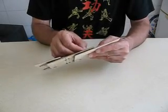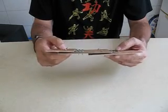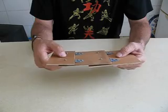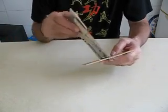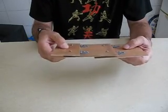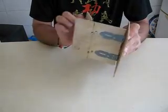This is my magnetic offset hinge — multiple hinge version — and it looks like a shingle on a roof. We just keep adding each new panel on top of each other, and it works like the single one. That one locks into place, this one locks into place, and it's very strong in this direction, but in this direction it collapses.